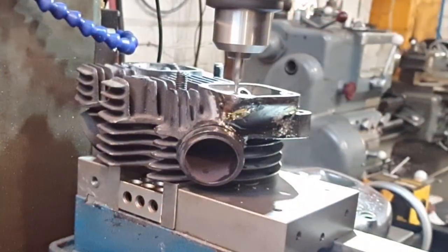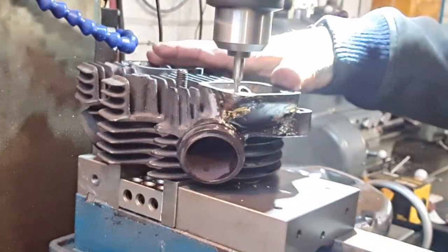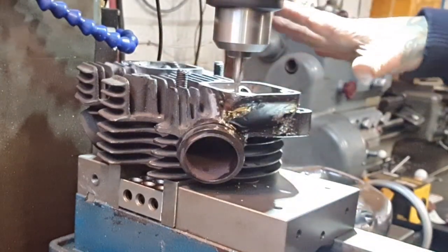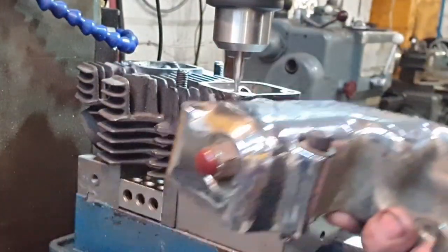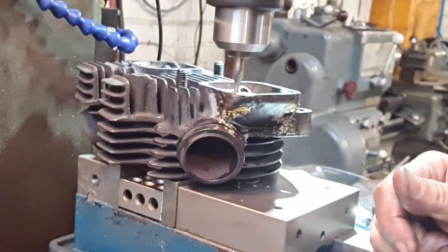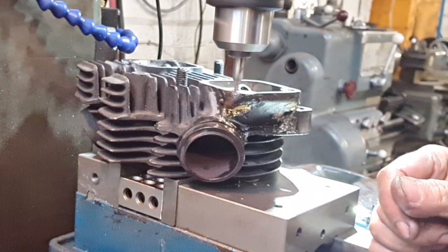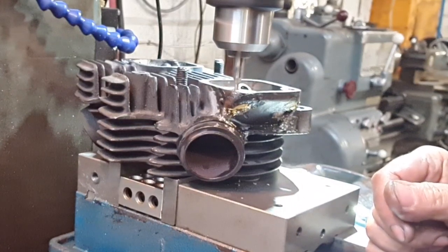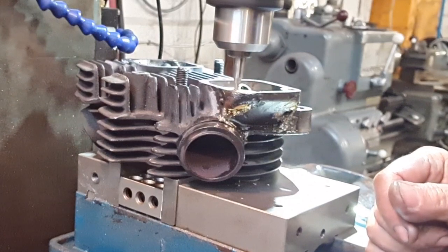Well, one of us spoke too quickly there with the one on the pillar drill. Well, let's come back to the big mill and set this back up on the 1-2-3 blocks and bolt the cover back on and go through one of the holes to check my alignment. This is tougher than a butcher's dog. I don't get it. I don't recall adding any diamond in there when I was drilling it.